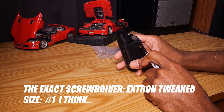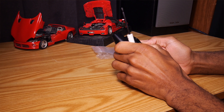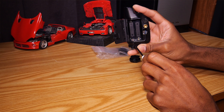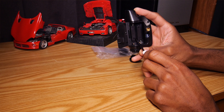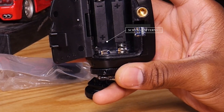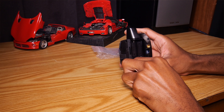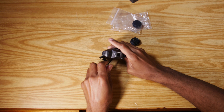Essentially, all you have to do is open the battery flap. Make sure you don't have any batteries in it, then you unscrew the screw that's on the inside and unscrew the back end and the front end. You'll see the one that's in the battery compartment — it's very hard to get to, but you don't need tweezers. I have big fingers, but once you get your screwdriver in there — my screwdriver is magnetized — once I get that screw out I'll be all good. It's right in the lower left corner of the battery section of the Pocket Wizard. Then once you get that out, unscrew the one on the front part of the Pocket Wizard.